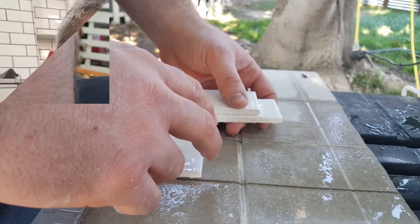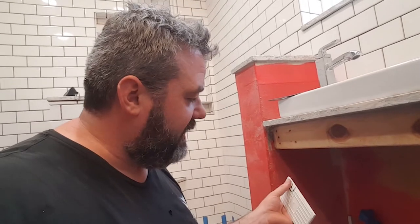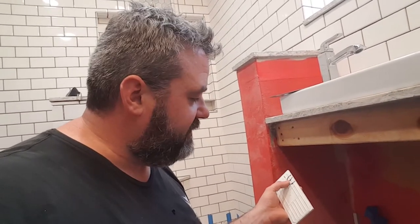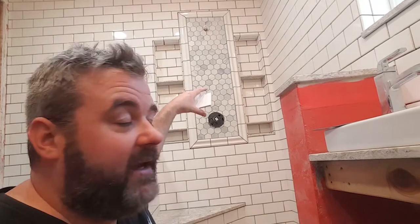As you're tiling, if you have some plumbing in the way, what I did is set the tile up there, made my mark on the left and right, then set it along the side to get my mark on the back. Since it's a curved pipe, I drew an arc to it. I'll take this out on the wet tile saw and try to cut that circular as best I can. There'll be grout and caulking around it and a cover plate to cover it up, so it doesn't have to be perfect — but the nicer you get it, the more it helps you hone in your skills.